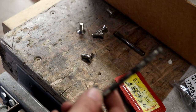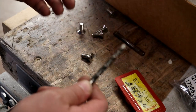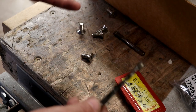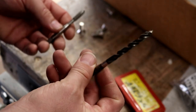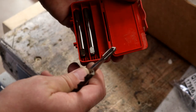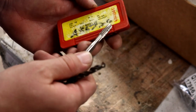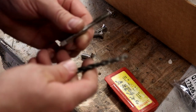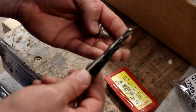That will give us a good ground on all the tanks and hook back into the main circuit board in the corner. This gives us electrical safety on all the tanks because they are insulated with nylon wheels. Doing it this way means they're grounded, and if we do have any shorts - like on the electric blankets or any other short - it will trip the system because it's got a direct route to ground. I've got M8 taps kindly provided by a local brewer, Mr. Colin Tweed - thank you very much Colin. We're going to put these Dormer E500 M8 taps through their paces and stick some ring terminals on to get the tanks earthed.